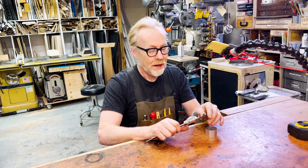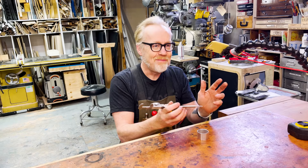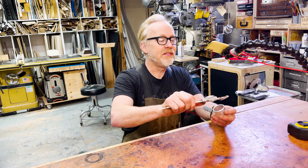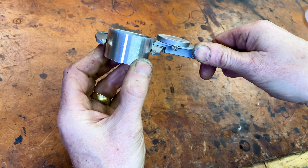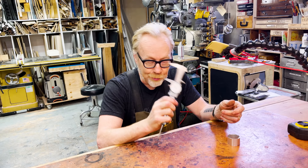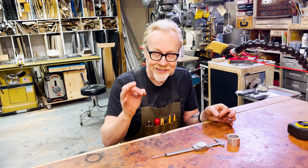For depth, while this is definitely a reasonable depth measuring tool for getting within a few thou, if you really want to check the depth of blind holes that you're working for manufacturing, there are depth micrometers. I also have an issue measuring the outside of a pipe — any tiny movement of the caliper gives me a slightly different measurement. So these dial calipers will get you really, really close, and your skill can take you the rest of the way, but for more and more precise outside measurements, you need a more precise measuring tool.